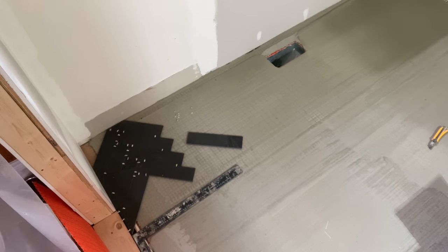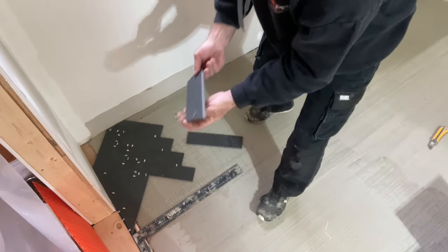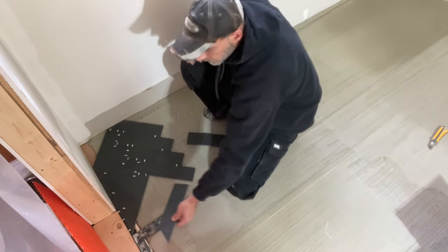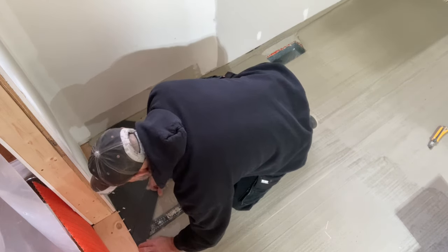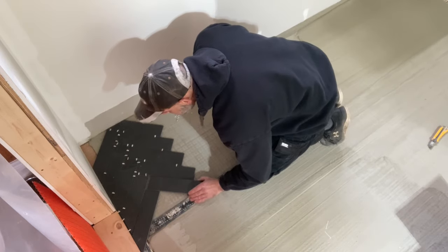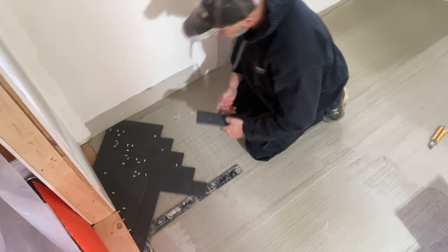Remember, if you follow my channel, we always do a dummy line to see how out of square the room is. I got a little lucky with this room. There's my cut — we're going to go against that opening and use a black tile ledge. We're going to have to tilt that up about a quarter inch with a wood threshold. That's not too bad — actually really good, especially when you're leveling.